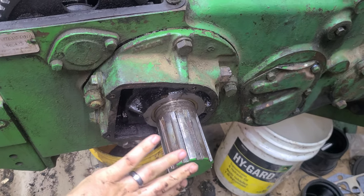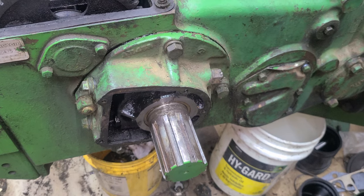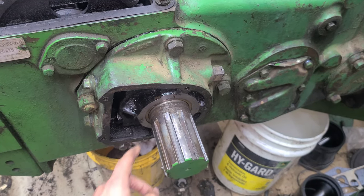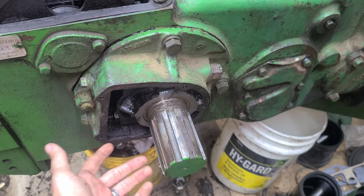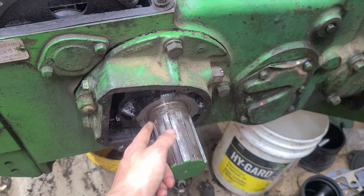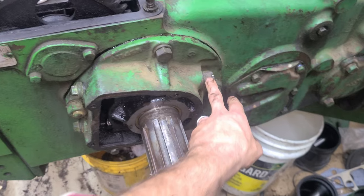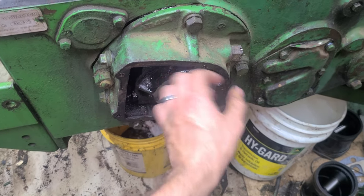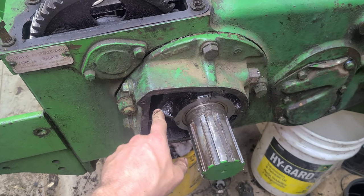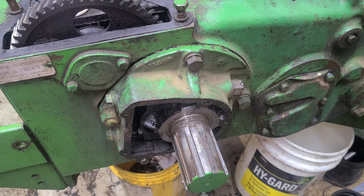I got the main bearing on the side. Before, in order to have the crank out, I had a long bolt here with everything kind of out a little bit, so I got this in. If you remember, I had new main bearings because I had a chunk missing out of the old ones. I checked and, just as I figured, this tractor was probably never adjusted and never worn enough. I've got about three thousandths clearance around it; it spins nicely. I put the flywheel on for a minute just to make sure it wasn't tight or bound up. I've got the nuts on, cotter pins in, and the plugs back in on the outside — those are so you can drive out the bolts in order to take this piece out or add shims.